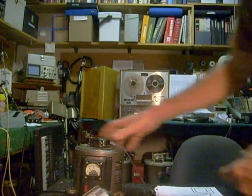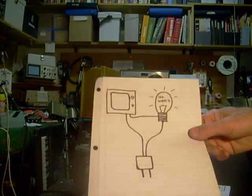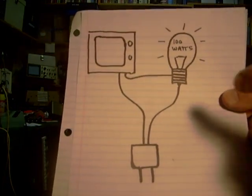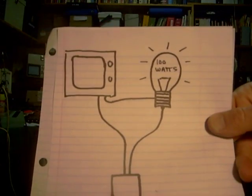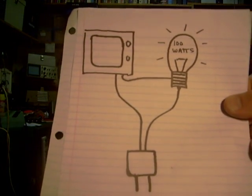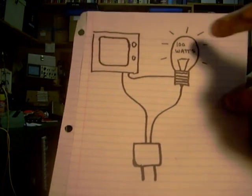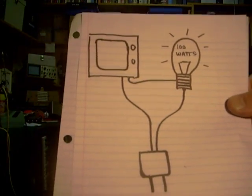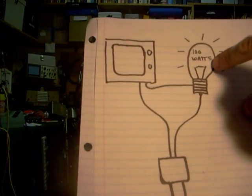There's another technique we used to use in another shop I worked in, where my boss would always have us put a light across the circuit — in other words, in series with the TV. Instead of going straight into the plug, the TV would have a light hooked in series with it. If there was a short circuit in the TV we just got done fixing, rather than blowing out brand new components, we'd know if there was a problem just by how bright the light went on. If the light was full brightness and the TV didn't turn on, that would tell us there's still a short circuit inside.